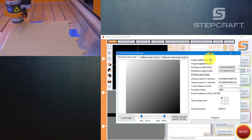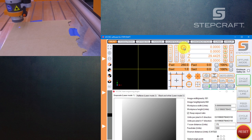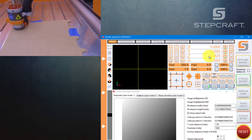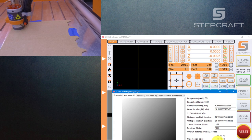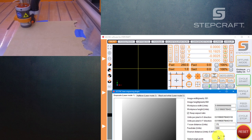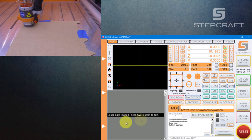First I need to set zero on X and Y, since I already have my Z zero from the sensor. I press 'go to zero' and start from the top. I'll move the laser a little to the back, adjust the camera angle, then create the G-code and send it to UCCNC. Now I press cycle start and it's going to start engraving the test square.